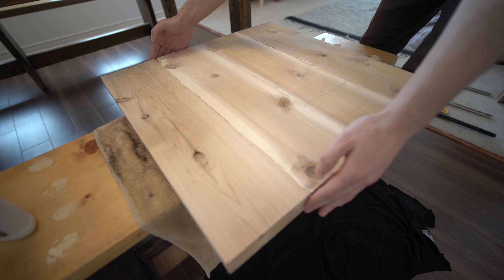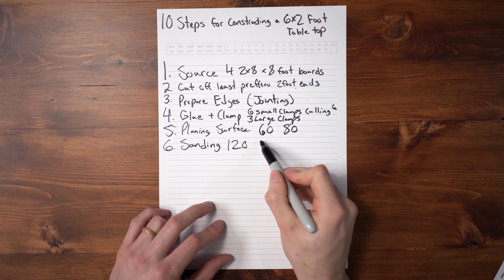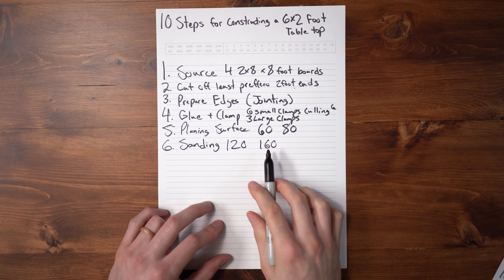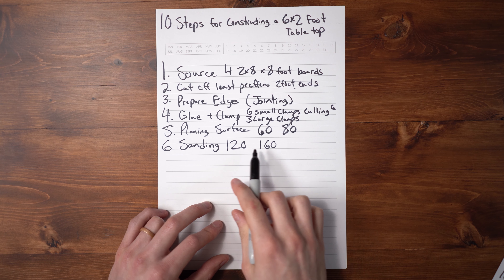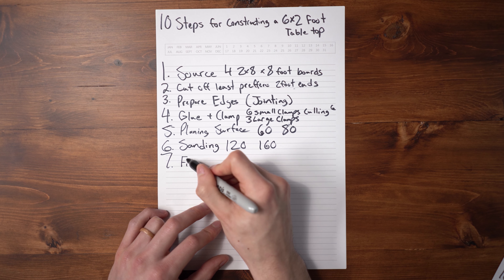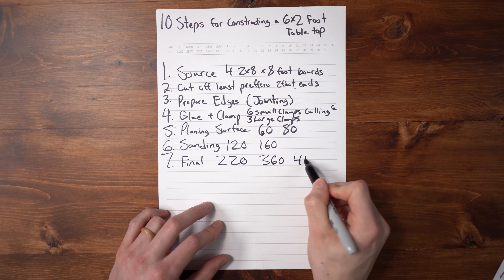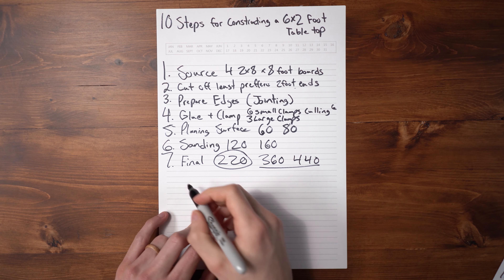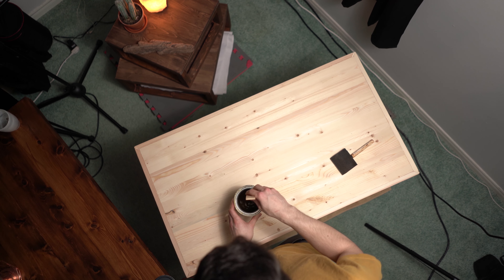Sixth is sanding — this will be the major part of our sanding work. Continue to level the surface with 120 and 160 grit, preparing it for the final finish. Every step makes sure you have a level surface without gouges, cleaning up any gouges made with 60 grit as you go through 80, 120, and 160. Finally, for the last sanding step, use 220 grit. You can even polish further with 360 and 440 for extra polish, but 220 should be all that's required unless you really want to shine.